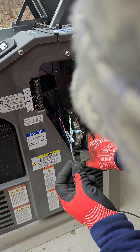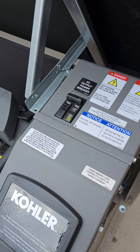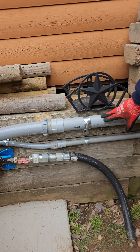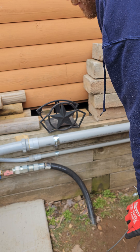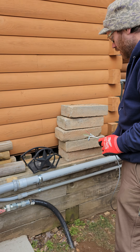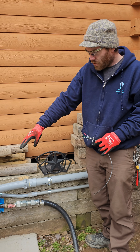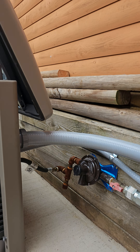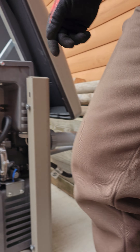You have your two hots and stuff for the breaker coming in. What's important is you have to run two separate pipes — one for your power and then one for your control circuit. They have to be separated so there's no interference. Right by the generator, you have a flexible non-metallic conduit going into the generator, and then it'll go to the transfer switch.